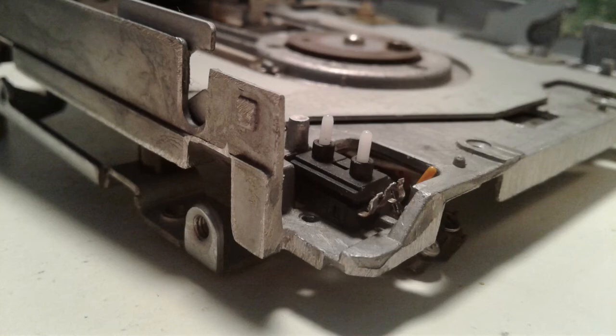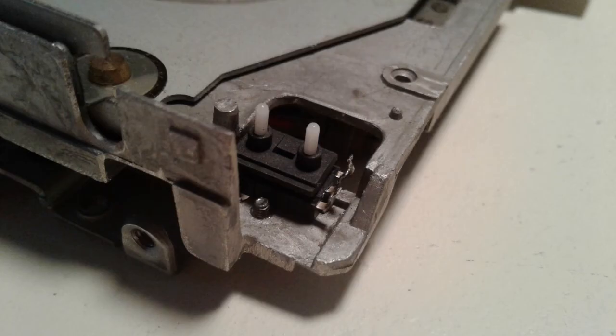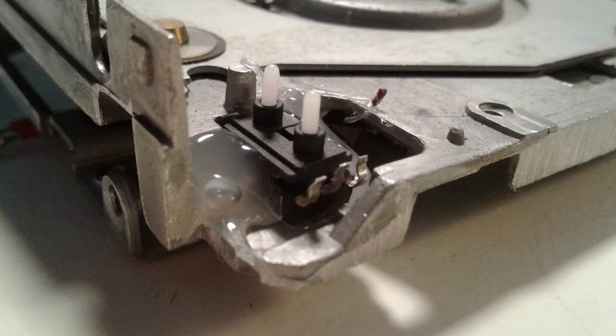This turns out to fit near perfect. There's a small ridge on the floppy drive's metal frame which clamps the switch in place. I've reinserted the old switch's screw the other way round, adding another point of contact. And here comes the hot glue — you have been warned! We apply some hot glue to the sides of the switch, leaving the soldering pads and switching pins untouched. We have some room for the hot glue here, so it doesn't have to be overwhelmingly pretty, and it's better to be safe than sorry. We'll clean it up a little when it's cooled down and fixed.